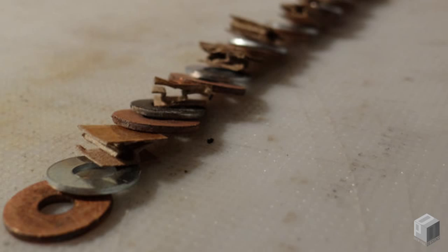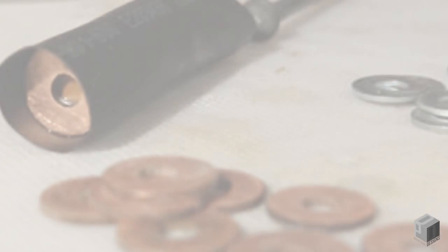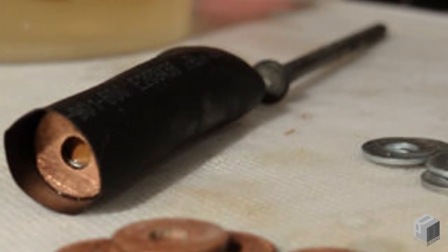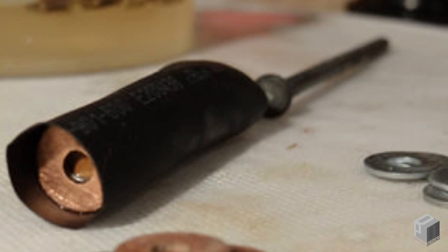To build the core, we will be stacking the components, making sure they are flat, without spaces, and without compressing the electrolyte mixture out. First, insert a copper washer, putting it 1/4 inch from the end and making sure it is horizontally straight. Next, drop a zinc washer on top and then add one of your soaked electrolyte squares. It is helpful to have a pen or a nail to push the cardboard down evenly. Just be sure not to press too hard.